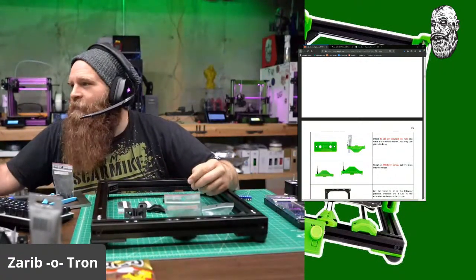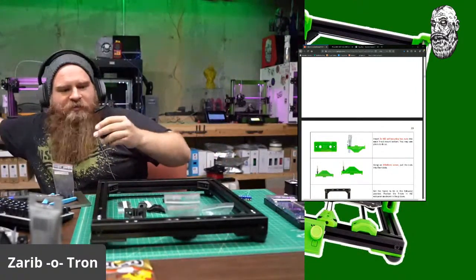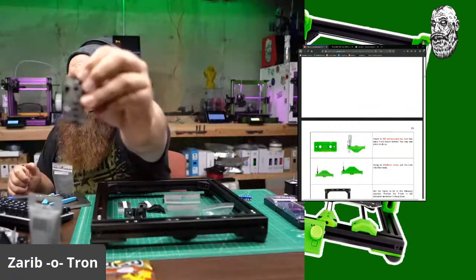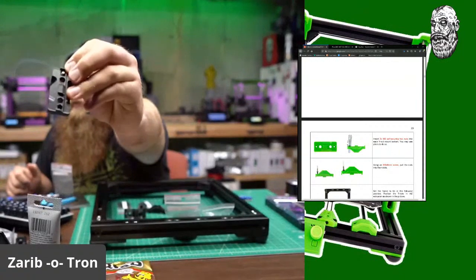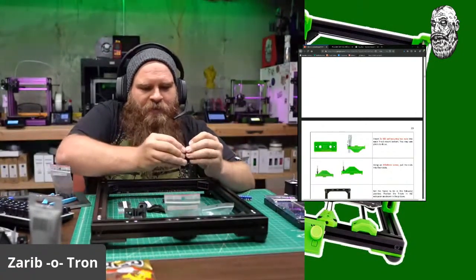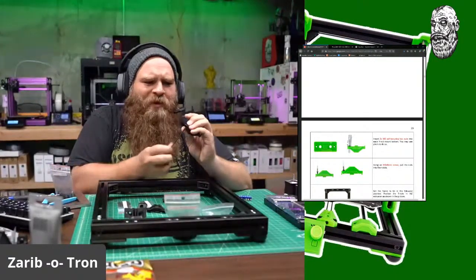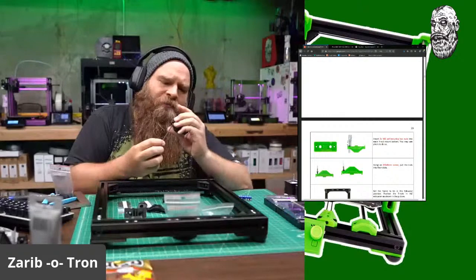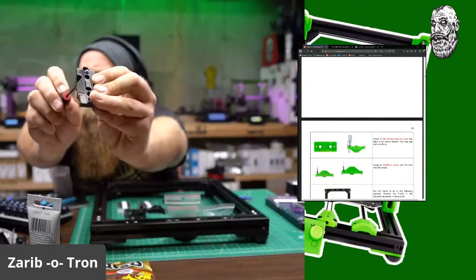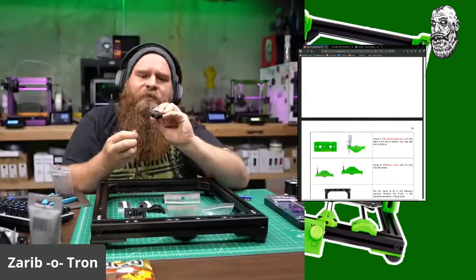Regular are correct. Okay. I have a different technique for attaching these because I don't like pinching 3D printed parts. I just use a screw. So I'm using an M3 screw right there, and I'm just going to tighten it into the slot. So here's my one deviation from the directions. I don't like pinching it because sometimes they end up going in crooked. And then as I'm tightening, the actual nut gets buried where it needs to get buried.